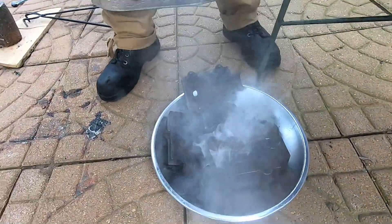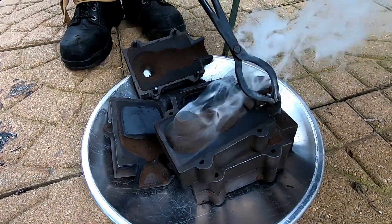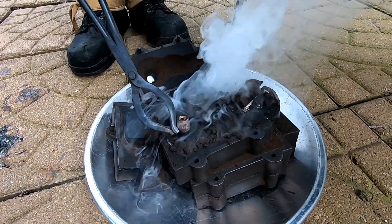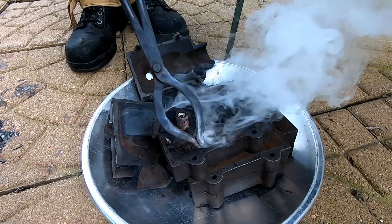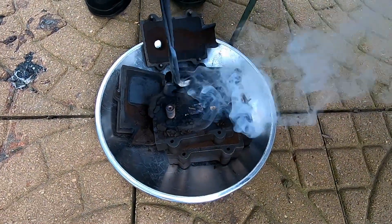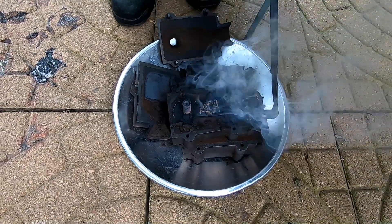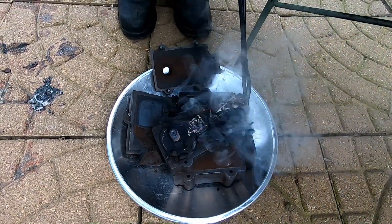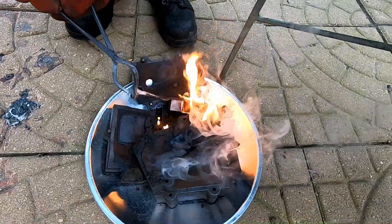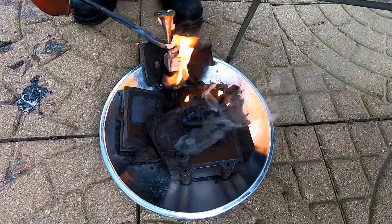You can see it in there through the smoke — it is there. We don't know what's there yet. I hope it came out because sometimes it's a bad pour and it sinks in that quickly. It looks like it's a bit tricky to cast sometimes. So far so good, but that doesn't mean much — you could have a big shrinkage spot somewhere and that could ruin it. It's still obviously like 1,500 degrees more than likely. Sometimes it gets so hot that the sand will just catch like that — see the fire right off of it? That tells you how hot that is. This sand is supposed to be basically non-combustible, but this is what's called green sand, foundry sand.